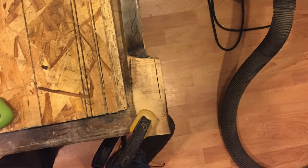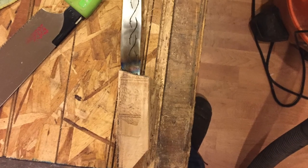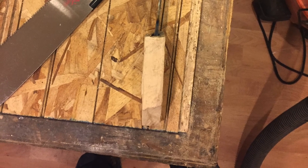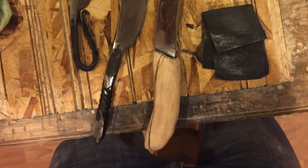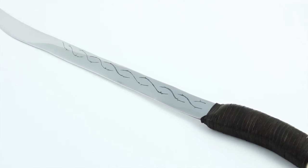Now that the block of wood had been attached, the first step was to trim it to size using a hacksaw. The handle was then shaped using a dremel with a sandpaper drum attachment. The last step was to wrap the handle with deerskin lace using a bit of adhesive to secure it.